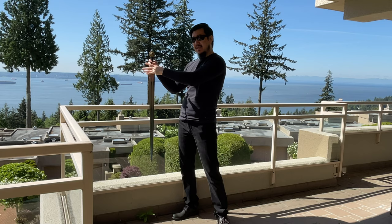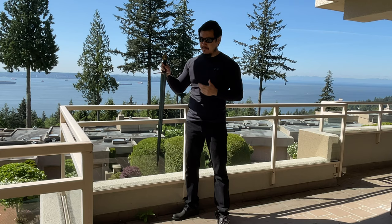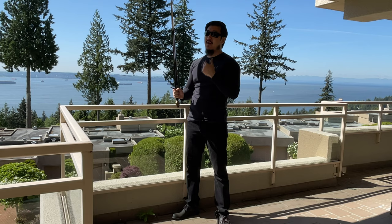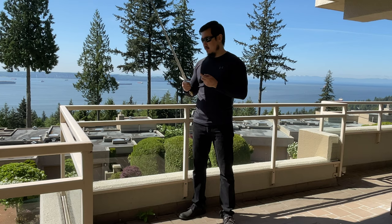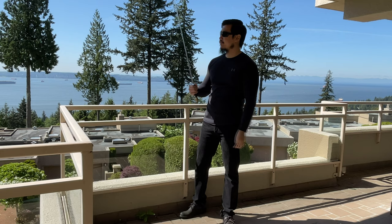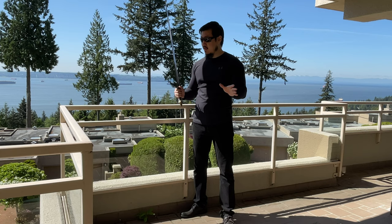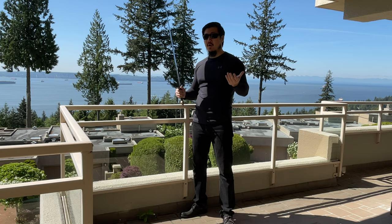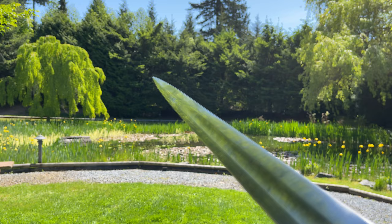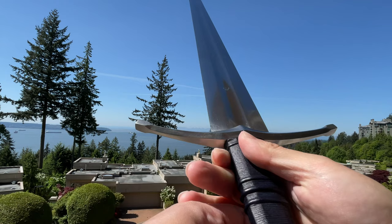The historical sword that featured this entire hilt — including the pommel, grip, and crossguard — is now housed at the National Museum of Denmark in Copenhagen. The blade on that sword is slightly different; as I said, it's a Type 14 sword. This blade, however, features a very typical diamond cross-section with full flat grind from the central ridge on the upper portion of the blade and a fuller on the lower part. As I mentioned earlier, it's very conducive to clean cutting and doesn't carry any additional unnecessary material on the blade, unlike the cross-section on swords of earlier medieval times. The edges are sharpened to a fine edge — enough to slice paper — but not overdone so as to jeopardize its durability. The edges of the fullers are perfectly straight and rather crisp.